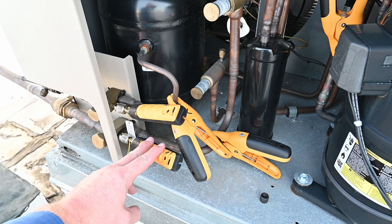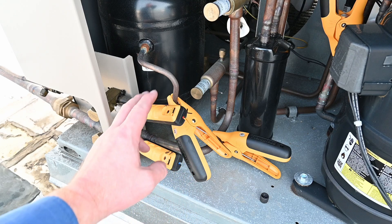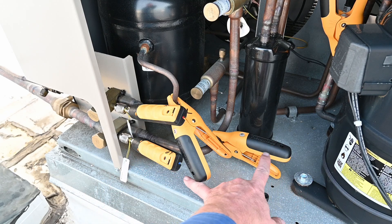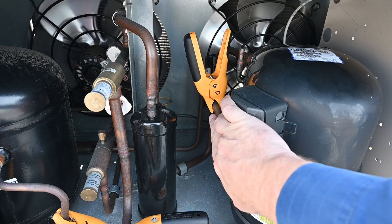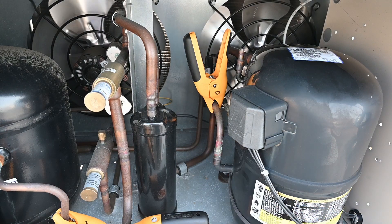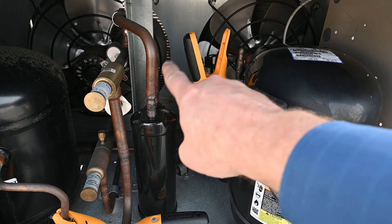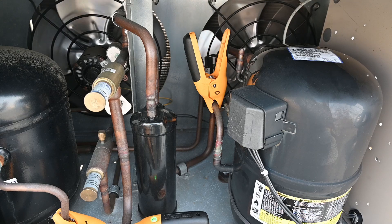What we're doing is using these probes to get our numbers. I have my low side probe here, my high side probe here. I'm measuring my actual liquid line temperature and my liquid saturated temperatures. Over here I have my suction saturated temperature, and here is my actual suction line temperature. With these two I'm getting my superheat. On the back side I'm also getting my discharge line temperature coming out of the compressor — we don't exceed 225°F.